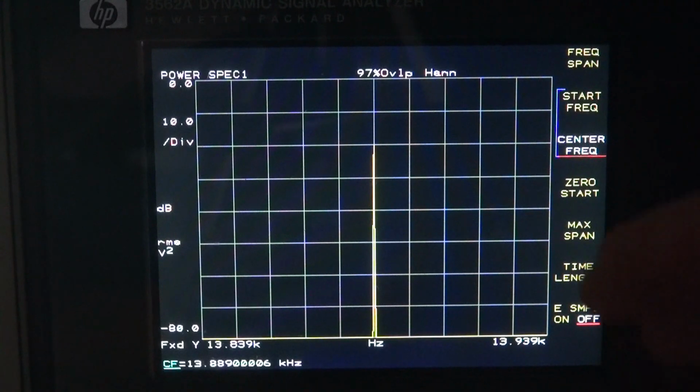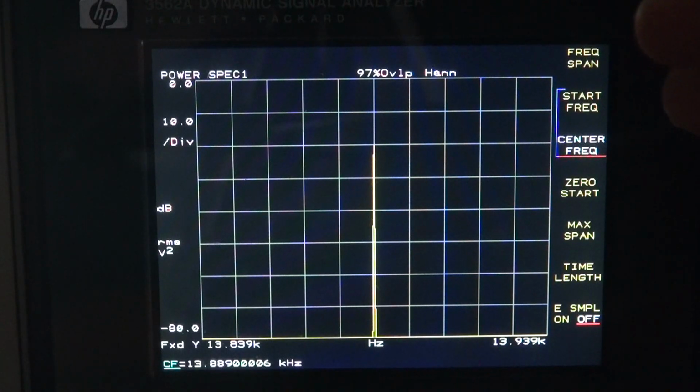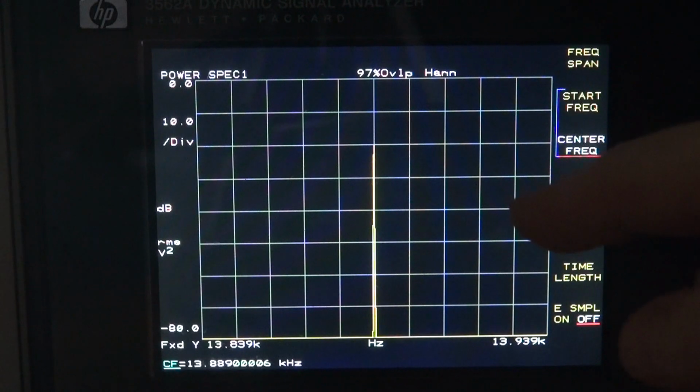And once again, this amplitude means nothing because I have not calibrated the head over distance to know if it really does mean something. But if I started having problems with this detector, I could easily set this back up the way it is and see if the power output has dropped. Naturally, your power output is also going to drop if you're using weak batteries, right? So try to keep fresh batteries in, because those batteries deliver the current to this coil to give you that output.